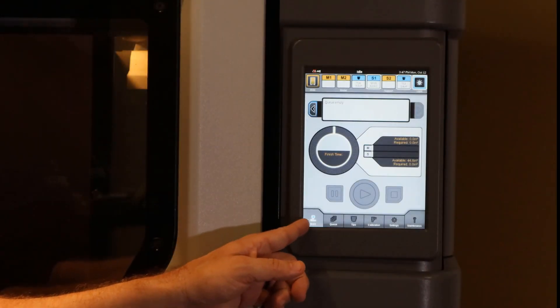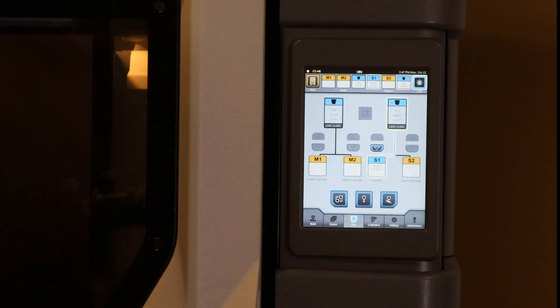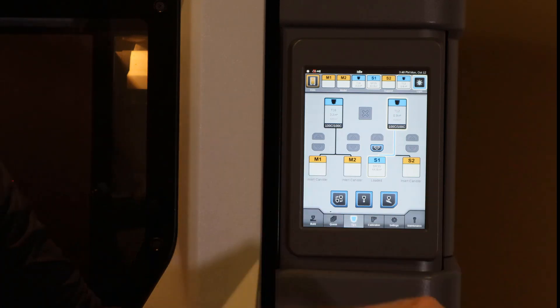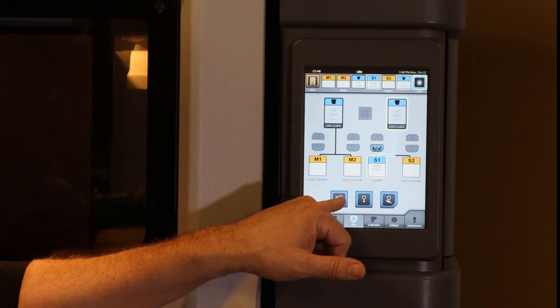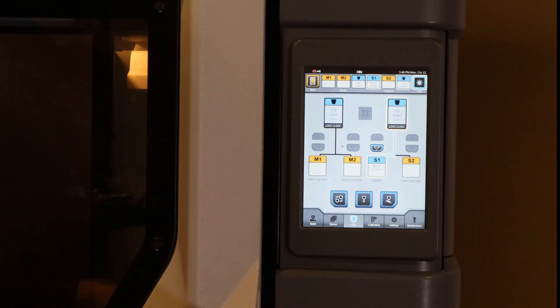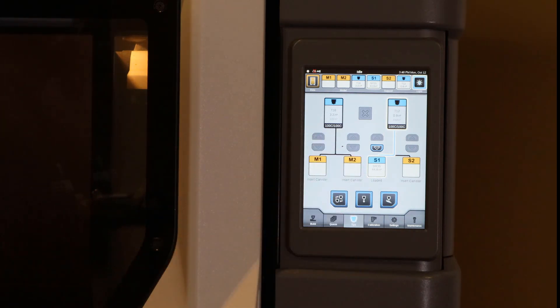Off of the main build screen, you're going to have an option on this system to press a button called tips. Under tips, the most popular one you're going to use is the first icon — the tip wizard. It will walk you through changing tips and materials, pretty much anything you want to do with the machine. But from there, if you want to manually load or unload material, you'll see these buttons get highlighted once material canisters are loaded. In this case, we have the button here for the support to unload it, so we're going to go through the process manually as opposed to the wizard.